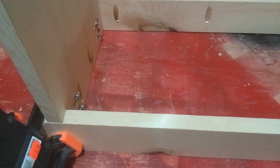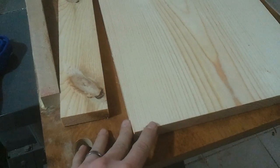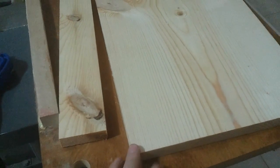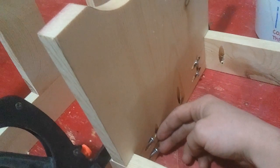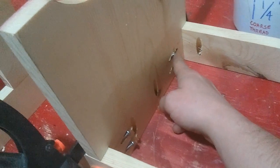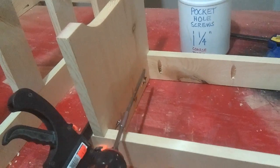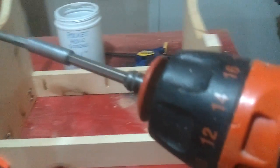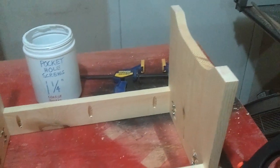I'm going to go ahead and screw these together. I'm not quite sure what profile I want for the top yet — maybe an OG, a round-over, or a chamfer. In these small areas it's going to be very hard to get a drill with a square-head number-two bit into the screws because of the adjacent piece. So it's always handy to have some of these little drill extensions. With an extension I'll be able to get the top screw from one side and then go underneath the rail to reach the bottom one. Keep some extensions handy when you're working with pocket hole screws.